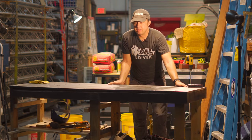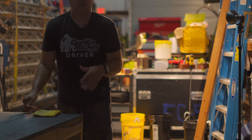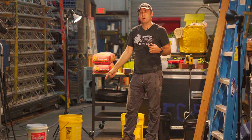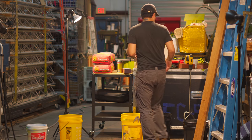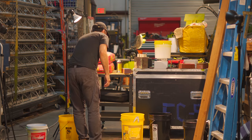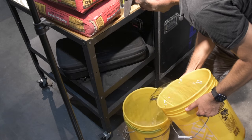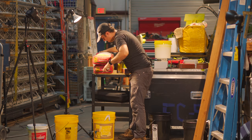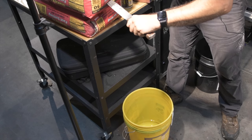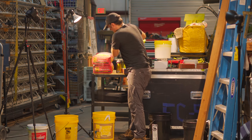You're gonna want a nice open space that you can really control. When I'm doing concrete, I have a full bucket of water and an empty bucket, and it's really great to be able to clean tools off — you don't want to let concrete dry in your tools. Start with a little bit of water in your bucket so the concrete doesn't get stuck on the bottom, then in a controlled manner you're going to add the mix.